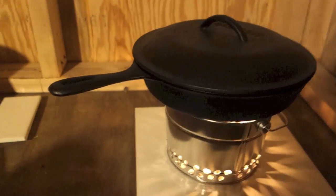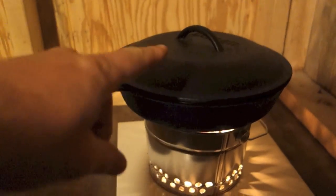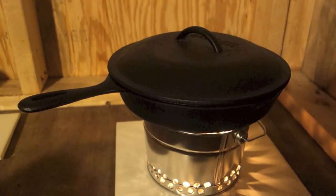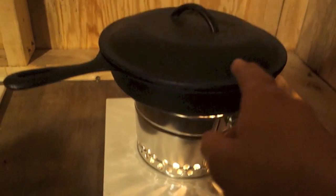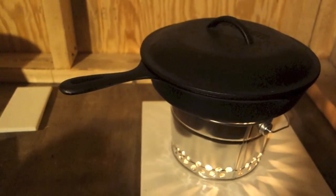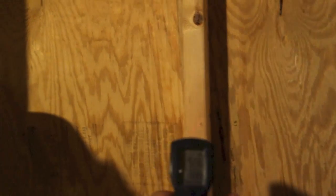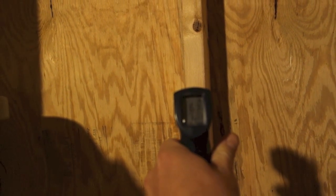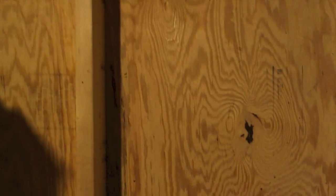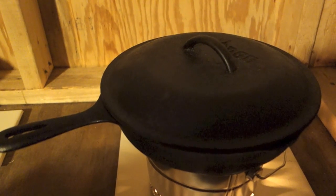My final thoughts on this heater is that it's a much more viable option and produces much more heat than the clay pot solution. In just 2 hours, the whole setup has increased in temperature over 100 degrees, hovering close to 170 degrees, and it's producing heat down here, up here, all around — even the handle is producing heat. It'll stay hot for a long time. Right now the temperature is 45 degrees outside and in here it is about 61 degrees — a temperature change of about 16 degrees. And this room is uninsulated, so I honestly think this heater solution is enough to heat up a small insulated space very efficiently.